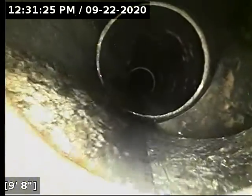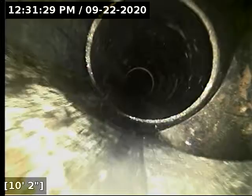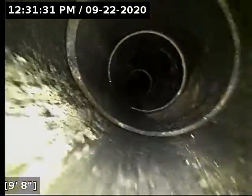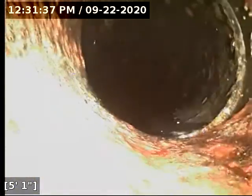One, the diameter is 4-inch. Party lines are almost always 6-inch diameter pipe. It's updated too, which would not have passed inspection if that were a party line connection there. It's likely the old downspout connection.